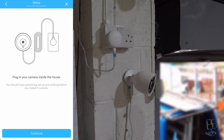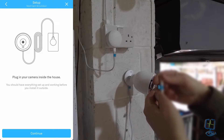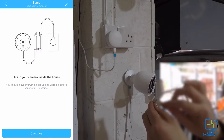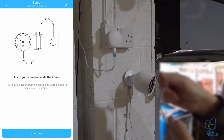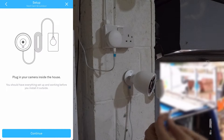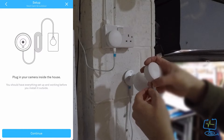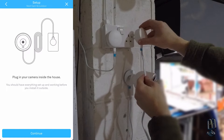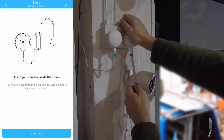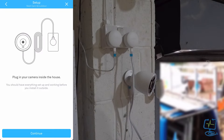Get the other end of your cable — labelled with little blue stickers — and this end with the power supply label is the socket end. It also has the small velcro pre-wrapped around the cable for tidying excess cable later. Remove the little rubber cap off the end and click it into the power supply. Now plug the power supply into the socket to power the camera on — you'll get a blue ring of light on the camera. Also take the protective film off the lens at this stage so you get a clear image when testing.